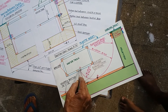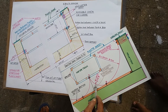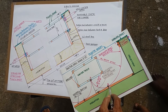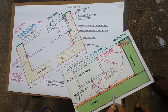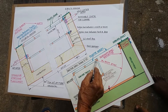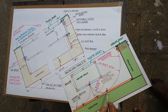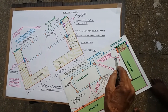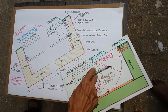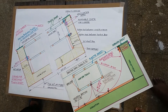From point A to point B, the reflector has a circular radius of 15 cm, with the center shown here. While from point B to C, this is the center of curvature and the radius is 30 cm. This dual-radius design ensures that whatever the angle of sunlight, all the light will fall on the surface of the tank.